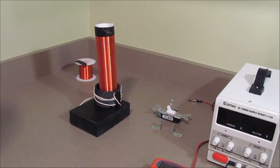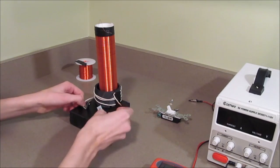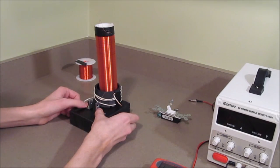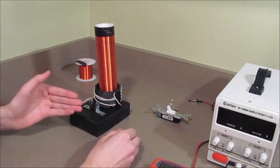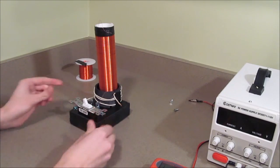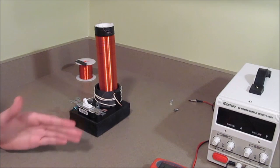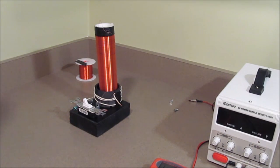Now I'm just about ready to begin soldering, and I think I'll use these angle brackets I found to solder things together. I'll run the resistor in between them and solder wires to either one respectively. Lastly, once I'm done with that, I'll screw on the switch to the edge, which will cut the ground wire, so that I can turn the circuit on and off by cutting its connection to ground. And I think it's time to begin soldering.